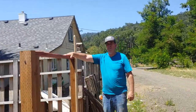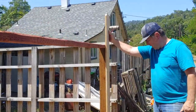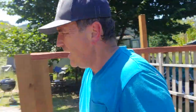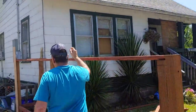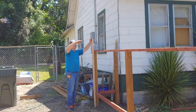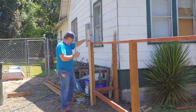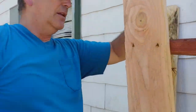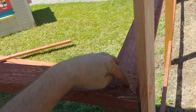On this side of the fence we've got our laterals up — two of them — and a couple of pickets in, one here and one down at the far end. We're going to stretch a line across the top from here to here so all the pickets are exactly the same height. Over here we put a 45-degree angle cut on the top of the corner pickets.